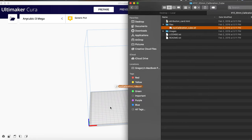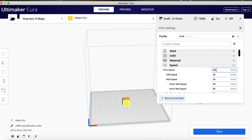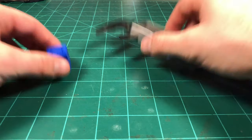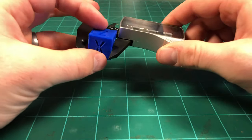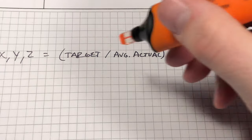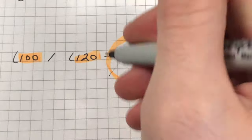If the extruder is calibrated and saved, it's time to calibrate the movement motors. Download the calibration cube linked in the description and open it in your slicer. Make sure to slow down the print speed and reduce the layer height so the print is as accurate as possible. This print will produce a 20 millimeter cube with a letter marking each of the three axes. Once the print has completed, grab your calipers and measure each of the three axes on the cube in multiple places. Take an average for each axis and jot those numbers down. We're going to use the same equation as the extruder — new value equals target divided by average actual, multiplied by the current steps per millimeter for that axis.